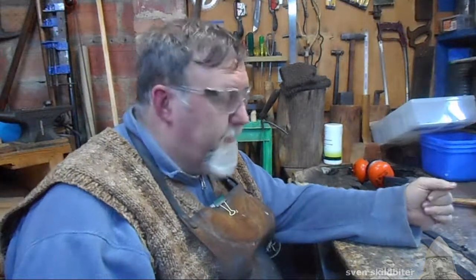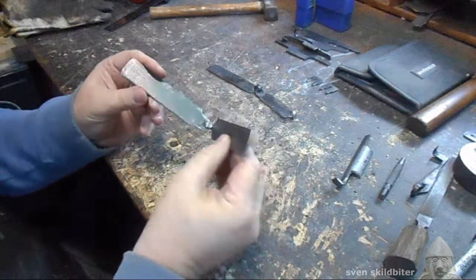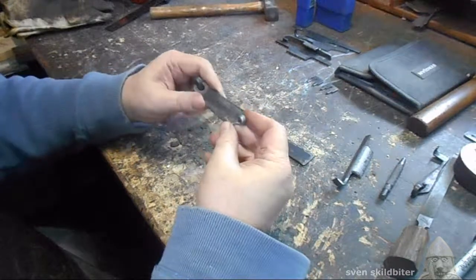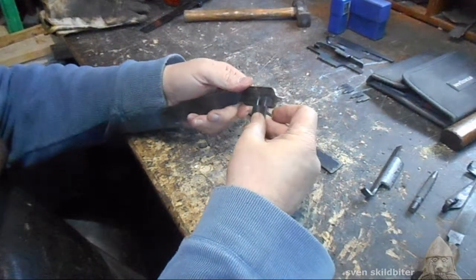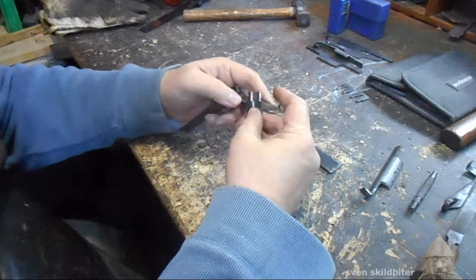This is the process of the making of the Winchester lock, the hasp. Okay, I'm still wearing my PPE. The process is to turn a hinge, a hook and eye hinge, into a hasp. So the only difference is there's a hook on the end, and I'm going to drill some holes for the lug, going to rivet that in place.